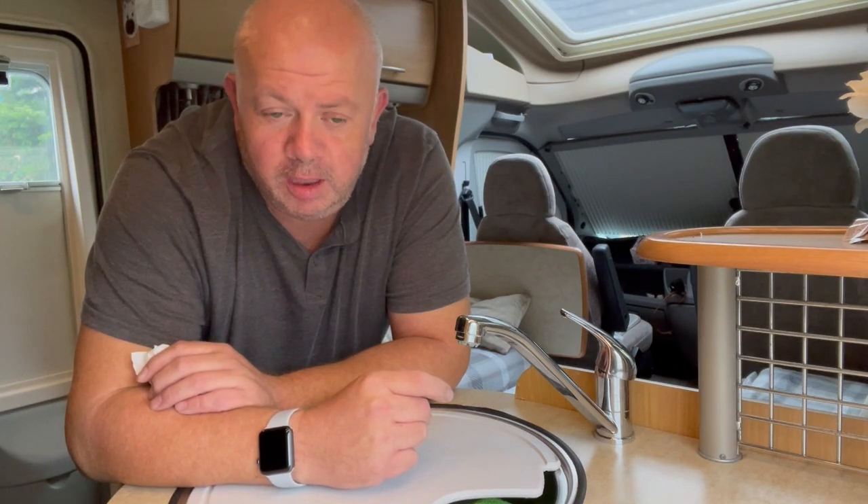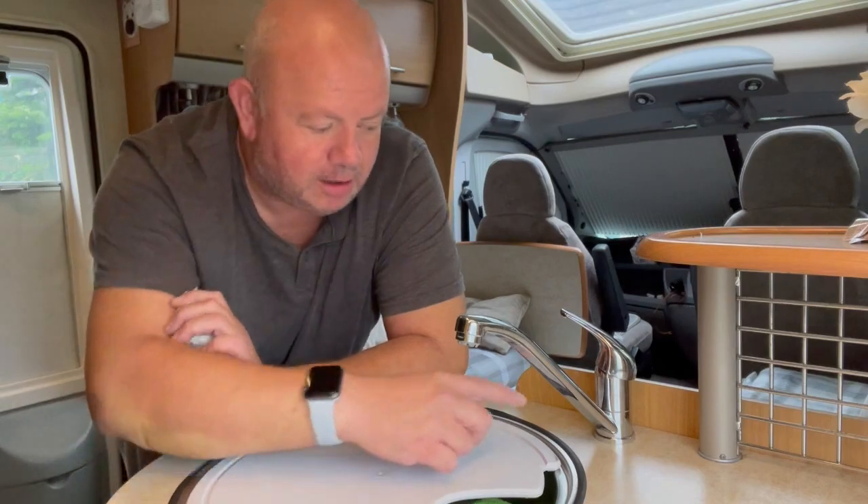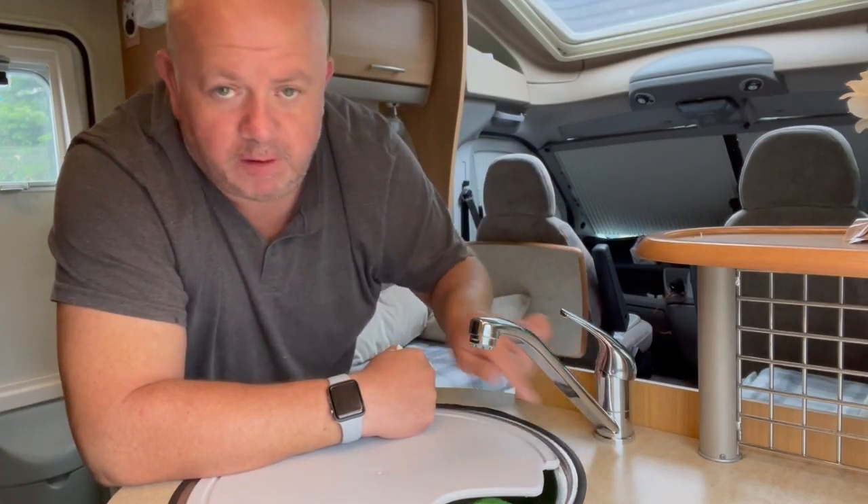Hello, welcome back to our channel. I'm going to go through some tips replacing the tap in the Swift motorhome. This tap is a standard tap that works off pressure - it's not the electric type with a contact switch where the water pump switches on when you open the tap. I have replaced the cartridge in the tap previously and it fixed it for a little while, but it started leaking again. Because it's now leaking at the bottom, it's no longer the cartridge that failed - the actual swivel part has a seal top and bottom, and I think that seal is causing the issue.